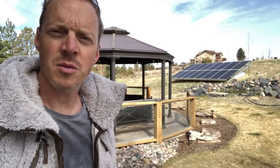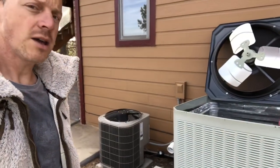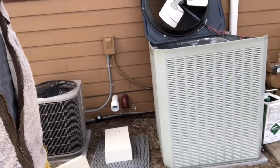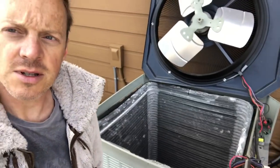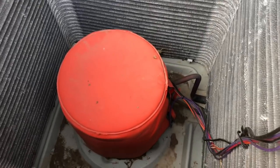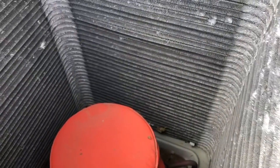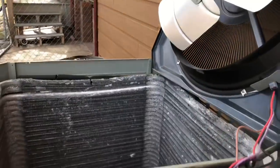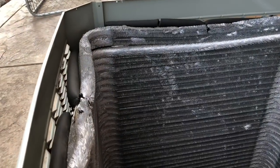I'm out here in the backyard trying to make our air conditioners run more efficiently by utilizing an air-to-water heat exchanger to improve on the air-to-air heat exchangers the air conditioner is designed with. Normally the compressor takes the refrigerant through the large suction line, compresses it into these coils which make it hot, and then uses a fan to suck hot outside air over these even hotter coils and cools them down.